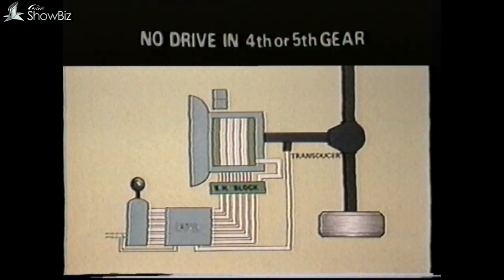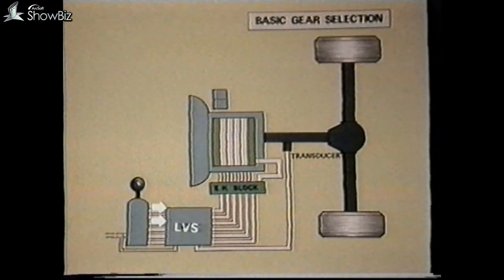If the fault has been the loss of fourth or fifth gear, you can still carry out the input checks from the change speed to the S plug on the control panel, and also manually apply each of these gears by lowering the solenoid plug on the EH block. But due to inhibition circuits on the control panel, you cannot carry out the bulb test on the EH plug as in third gear tests, unless an oscillator is used to feed the panel with a speed signal.